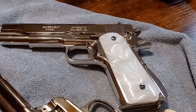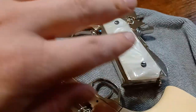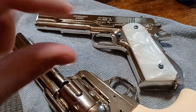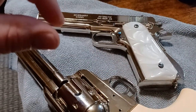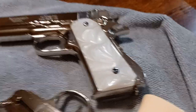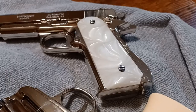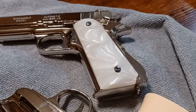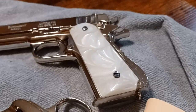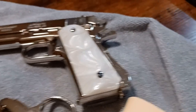The drilling is a nightmare — that's the hard part, trying to get the new holes right. The metal frame actually has a half-sphere, like a dome circle, with the screw hole in the center, so you have to replicate that on the back of the handle, which is a real pain. I wish I had a dremel, but here in my apartment I just have drill bits and a drill, so I had to try to replicate those dome shapes with that.